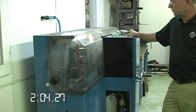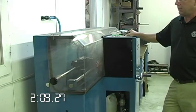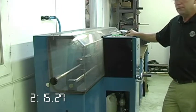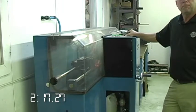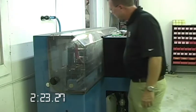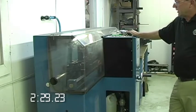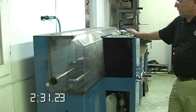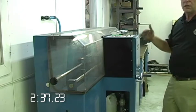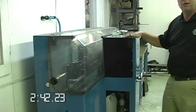How many grinds can you usually get out of a bed knife blade like that? Depending on rate of wear with top dressing — three, four, five grinds. Because typically when people talk about those, they talk about one or two grinds. Oh, we get a lot more than that out of them with this grinder. What I like about this is you have real finite control on both faces at the same time. So if I see that I can take a little bit more off of the front and get a good cutting edge without having to come in on the top, then I'll do it that way.